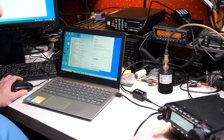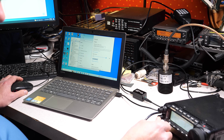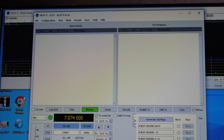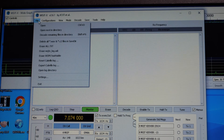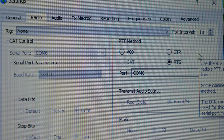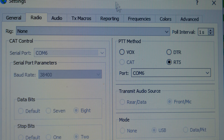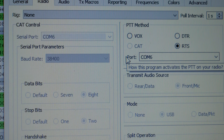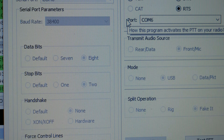Now that the hardware is connected, we move to software configuration. I'm going to focus on WSJT-X, but it'll be similar for other digital packages. In WSJT-X, open File > Settings. Under the Radio tab, set CAT control to None — this will gray out most of the form. Then for push-to-talk method, select RTS and also select the port your DigiRig is connected to — in my case, port 6. Finally, test things by pressing the test push-to-talk button.